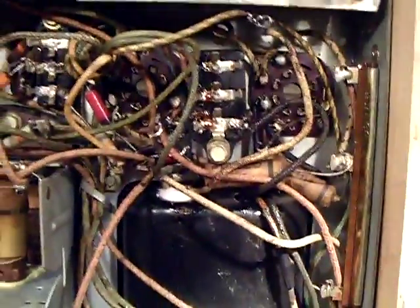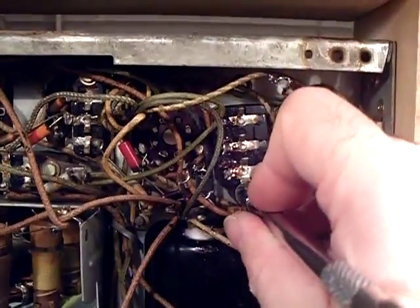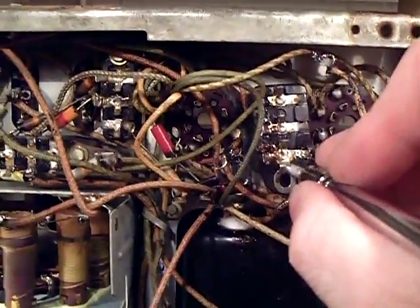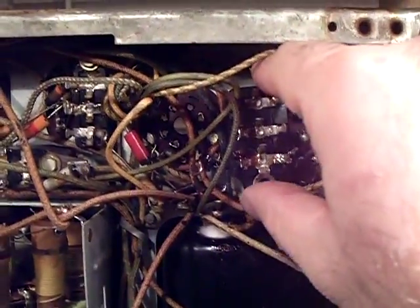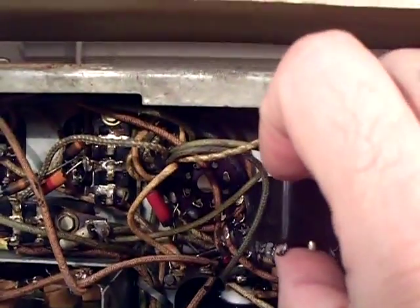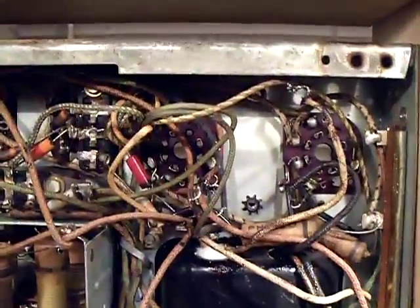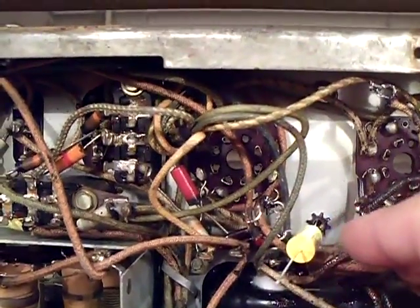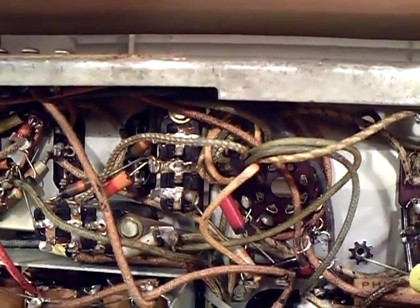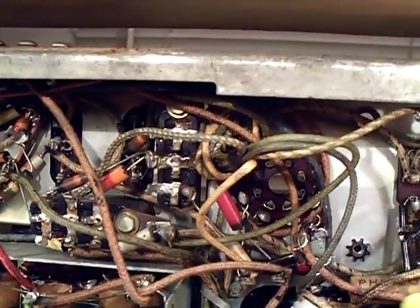I show how to rebuild these and I got that procedure from a friend on YouTube — I mention all that in my Philco 16 radio rebuild video if you want to see that. This is just a quarter-inch socket. I already loosened it, and then you take this out real careful because there's a lock washer on the other side. The lock washer is still stuck on there — that's good because it actually bites into the chassis. You can stuff a lead through the hole and knock it off if it's loose, then let it fall down on the lead.